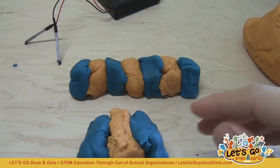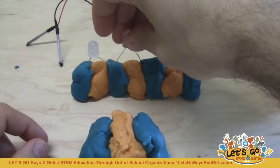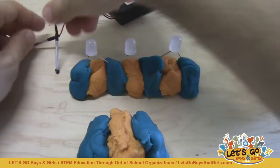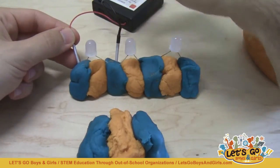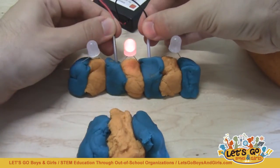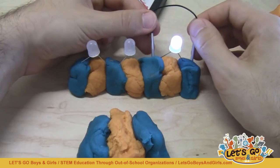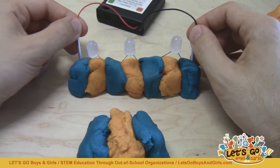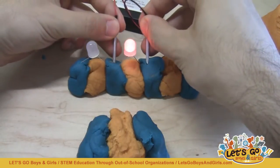Let's test series first. I'm going to take three LEDs and plug them in all in a row here, and I want to make sure individually I've put them in in the right direction. I'll take my red and black battery pack leads and plug them in — it looks like I've put that one in backwards, so if I flip it around, you see that one lights up. The red one lights up, and the white one lights up. So there's nothing wrong with them individually; if I test them one at a time, they all light up.